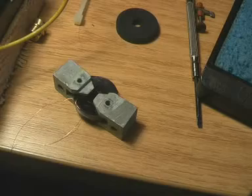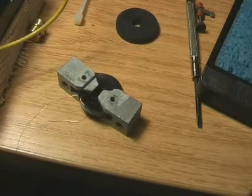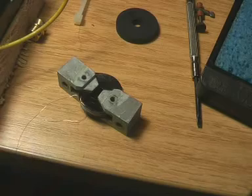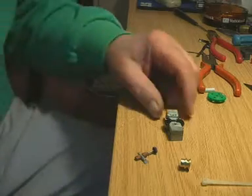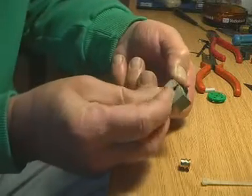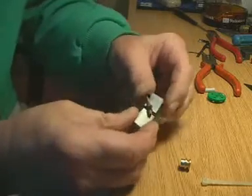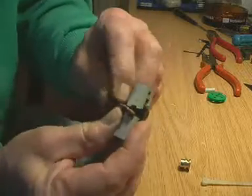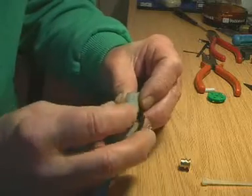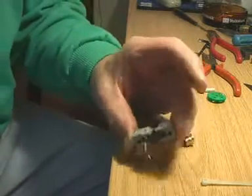The coil is thinner and has gone into the pole pieces, but there are one or two turns spilled. I'm going to carry on with this as we're progressing. This was the front of the assembly, so I'm going to put the armature back through - that's why it has a square hole, because it lets the spade go through. Then place it in between the rubber suspension - the orange or brown bits - and once it's gone in between it will go down and locate like that.